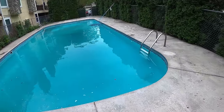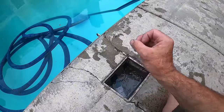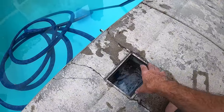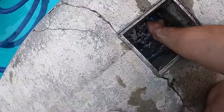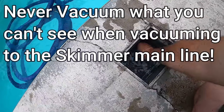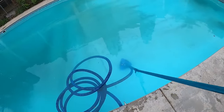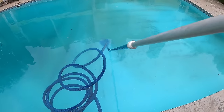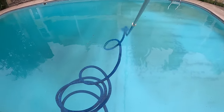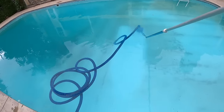If you need a tutorial on how to vacuum your pool manually, check out our how-to-vacuum-a-pool video in the description box. Normally I use one of those skim-vac vacuums over the skimmer basket to collect everything, but these skimmers are square so I have to mainline it and just be careful not to suck up too much at once and plug the line. As soon as we start losing suction on the vacuum we'll shut the system down, open up the pump, and clean out the basket. I'm sure it'll be completely full of evergreens within a few passes when we get to the deep end.